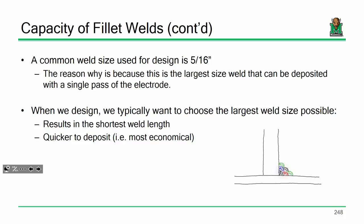In design, we're going to select the weld length based on limitations. We're more often than not assuming 45-degree angles. Rarely are you going to have one weld leg way larger than the other. In fact, in a design capacity I don't think I've ever encountered one — we've always assumed 45-45-90, so the legs are the same size.